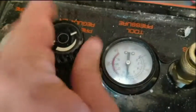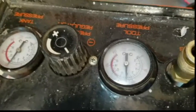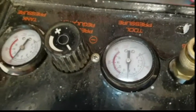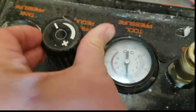For our first step, we are going to need an air compressor, an air hose, a staple gun, staples, fiberglass mesh blankets, and a utility knife, as well as a ladder that's going to help you reach the top of the ceiling. First, let's go ahead and let the air compressor warm itself up. Plug it into the nearest outlet to the wall. Extension cords can burn out the motors to larger machines such as this one, so try to avoid them.